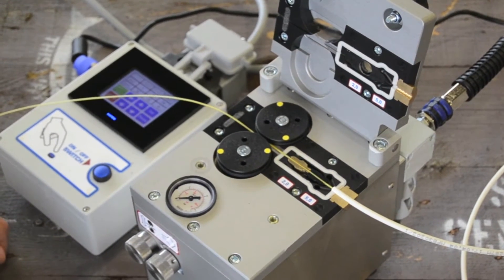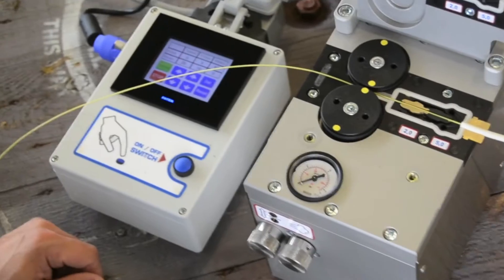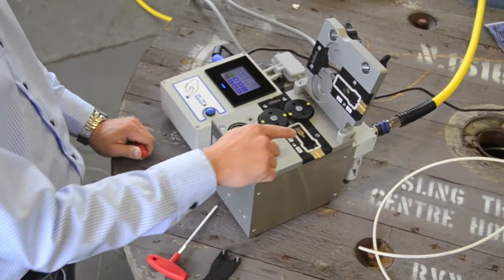You can also use the buckle protection for fiber stop when the fiber cable reaches the end, by using a fiber stop mounted at the end of the micro-duct. This ensures the right amount of fiber is used for the job.